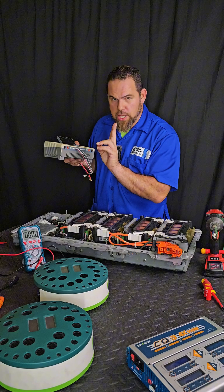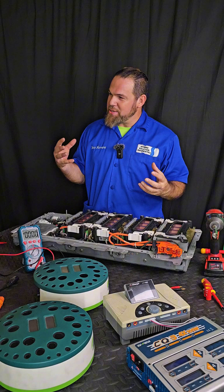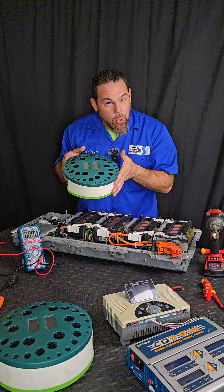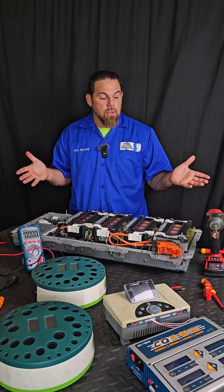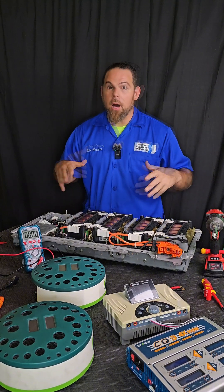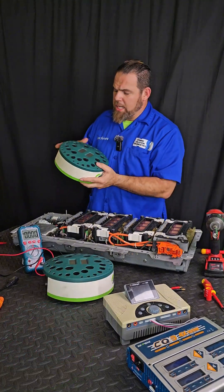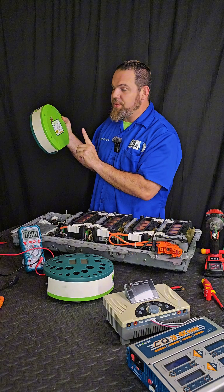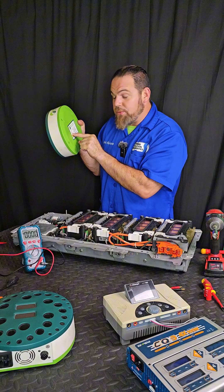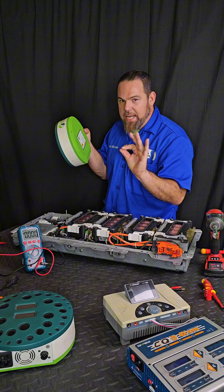A second option is a two-channel RC charger that charges a bit more aggressively. But there's an alternative: charging the battery collectively by connecting it to a high-voltage charger. I'm going to use a low-current high-voltage charger. Since this is a 210-volt battery, I need a charger capable of delivering above 210 volts. This first unit gives 180 volts at 350 milliamps — not enough. This other one provides 250 volts at 350 milliamps, which is perfect.